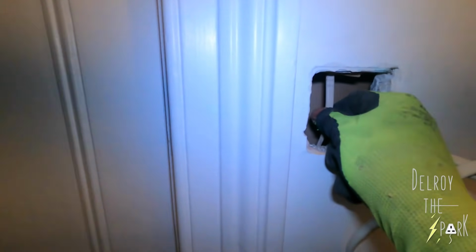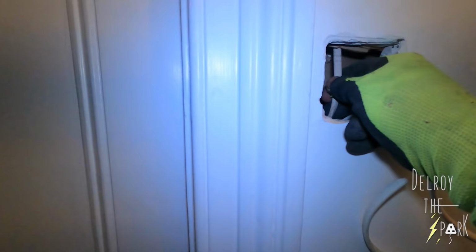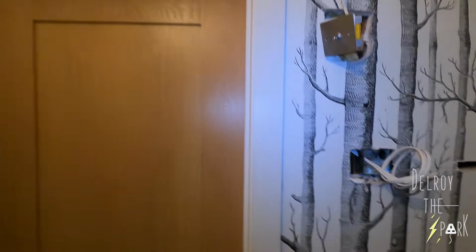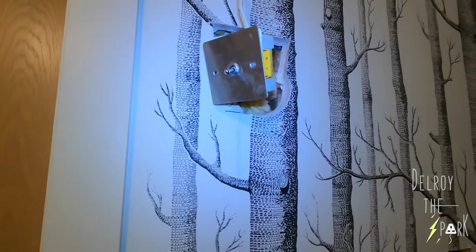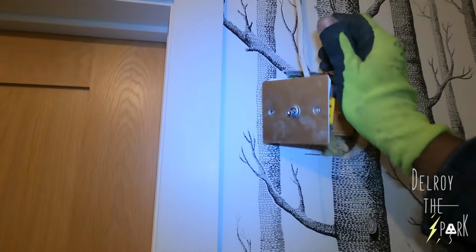So, when I saw this, I thought, okay, seeing that it's switching, you could switch on both lights upstairs and downstairs from here, and you can do it from down there. But there was no 3-core to do the two-way. Right, so when I took it off, I thought, okay then, this must be the switch line coming from there, going down to that switch. When we tried to pull it, we couldn't get any movement. So last night, so that it could allow light, I connected this, the switch line that does both lights. That's off, that one's off, yeah.